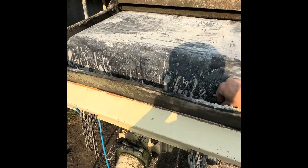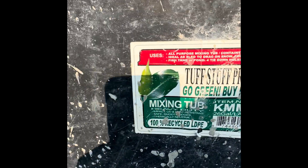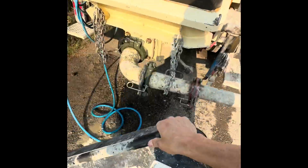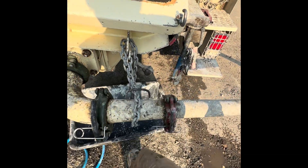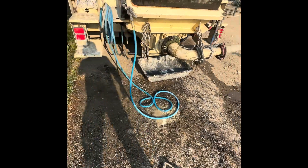Another good tip - I got this from Jeff over at Muddy Feet Concrete Pumping. These pans are from Tractor Supply Company. Love these things. They work as a hopper lid. They're the perfect size to put over the hopper when you want to pump out. They're nice for putting under the elbows and under the hopper when you're hooking stuff up to catch any spill. And they're great for washing out into - they're rigid enough you can carry them and they don't fold in half like the softer rubber pans.